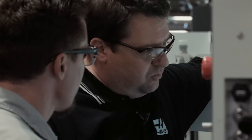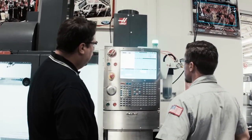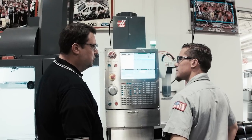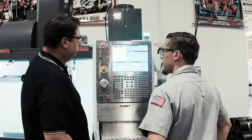Whereas we can see the through spindle coolant coming on — we're running 15,000 RPM, a single shot. And wow, we're already on the last hole. We take a look at that cycle time: we did those six holes using the high-speed steel drill and flood coolant in almost 50 seconds, and it took a little over 20 seconds to punch all six holes with the carbide TSC. Correct.